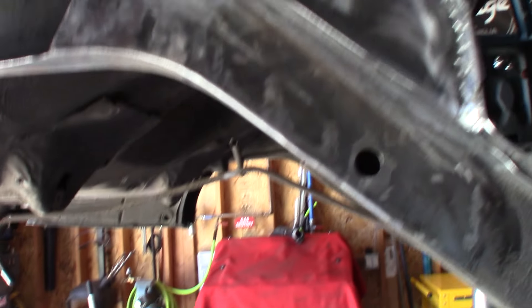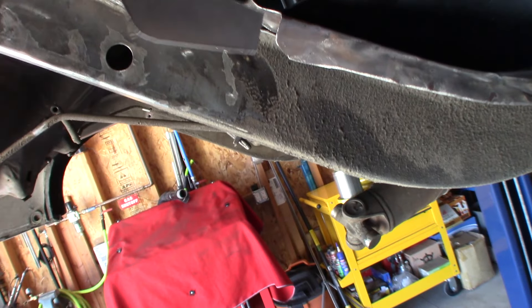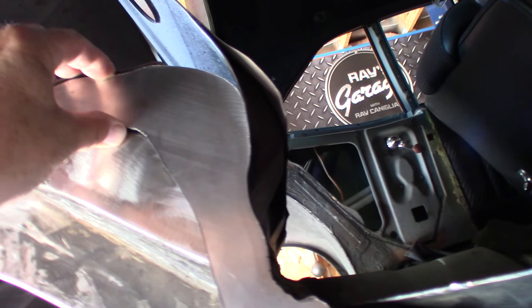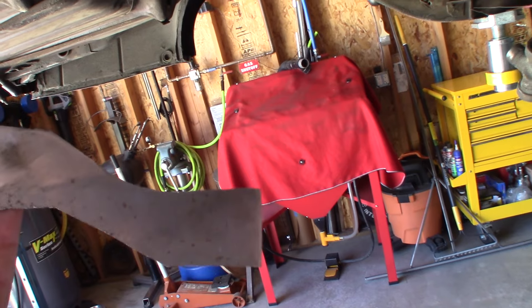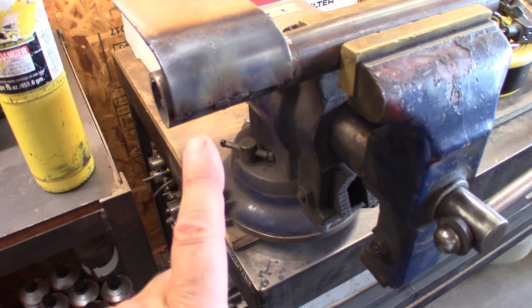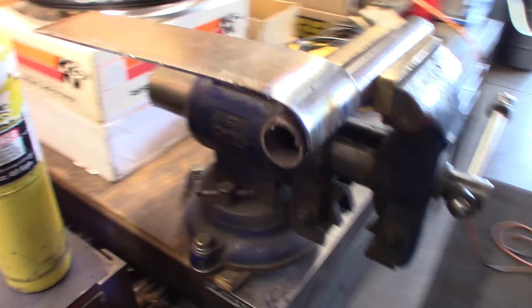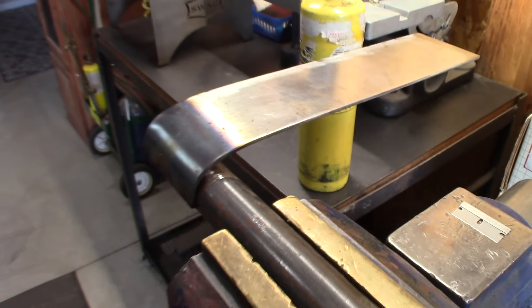I got this cut out from the template you saw in the last video. This is going to fit up in here like so — it's got to be trimmed up. It's oversized right now, but it's going to tie all that material in that I removed. I just cut this out on the do-all bandsaw with a 24-tooth metal bandsaw blade. To make my bend, I took my three-inch wide piece, welded it to a pipe that's a little undersized of the radius I wanted, then just heated it up with a map gas torch and pushed it over. I got a bend that's close to what that frame needs, and I have extra material so I can grind off what I don't need.